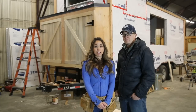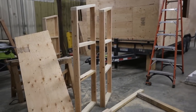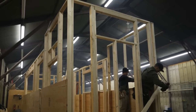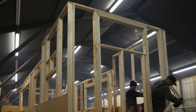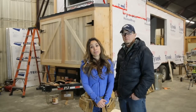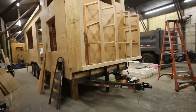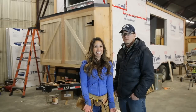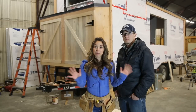This one was really easy to frame. We just made up five different sections, basically like little mini walls, so they could tie into the five studs on that back wall. You could have probably got away with three — I just tend to do things overkill, and three would have saved some weight. Definitely screw and glue these together. I plywooded the two ends, but we really regretted that later because I couldn't fit the shelving in, so we had to cut the shelving. It was a bad idea — definitely leave the plywood off.